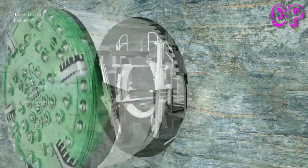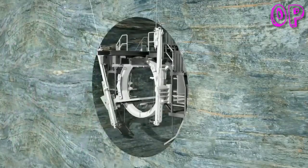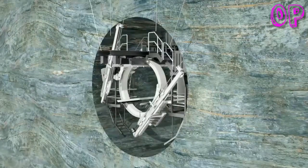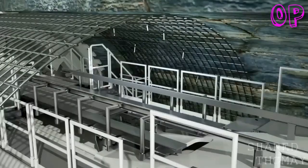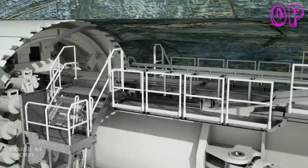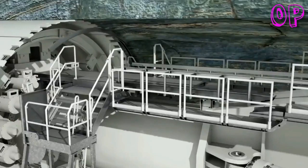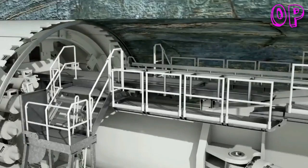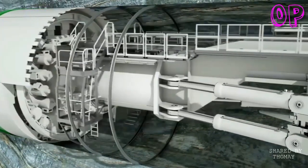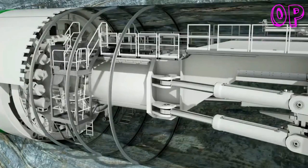When tunneling through more fragile geological formations, the tunnel wall must be additionally stabilized. In the front shield area — the so-called L1 area — effective measures for early temporary rock support are possible. Roof bolt drilling rigs create radial bore holes directly behind the roof shield to install rock bolts. Steel mesh mats can also be put into place, positioned directly behind the roof shield, serving as protection against rock fall. Steel ring beams also help secure the tunnel; they are pre-installed directly under the roof shield, then moved to the installation position, braced against the rock, and mounted. Depending on the geology, rigid or flexible ring beams are used. The rock condition, with its geological and geotechnical characteristics, is decisive for the type and extent of rock support, which is the key factor for the advance rate of the TBM.